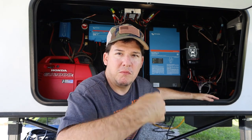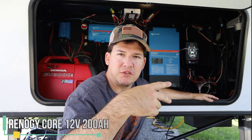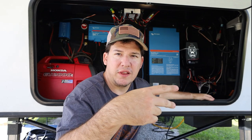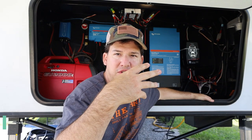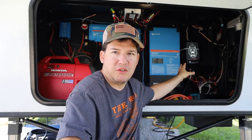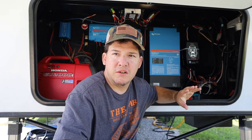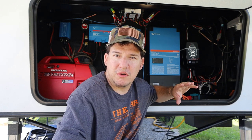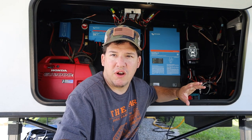I had to route the cables further back through the wall. We have two 12V 200Ah batteries wired in series, which doubles the voltage while amperage stays the same — so we have 24 volts at 200 amps. That's what this Victron is made for: a 24V system. There are 12V, 24V, and 48V inverters from Victron, so make sure you get the right equipment.